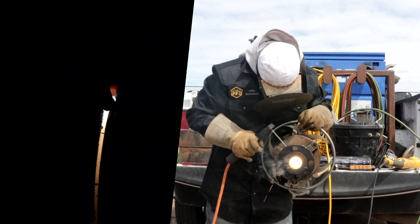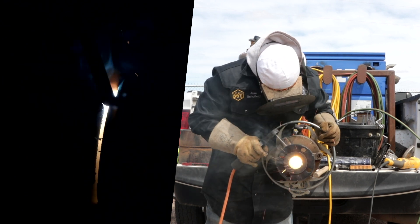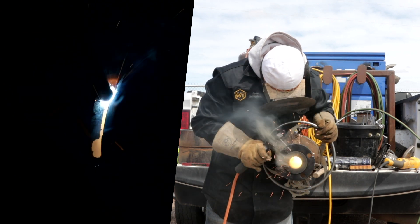Alright, we're back on the rollout wheel — mostly because this is what I do a lot of. It's such a little piece that it would make no sense to weld it in position, so it's easier to roll out. Coming into this other tack — all we have right here is an 1/8-inch 5P-plus, 3/32 gap, probably 3/32 landing, pretty close. It's just a 2-inch schedule 80 with a 150-pound flange on it.